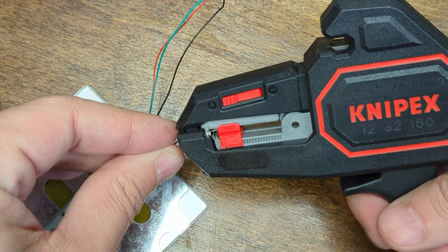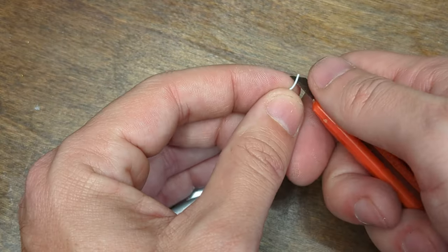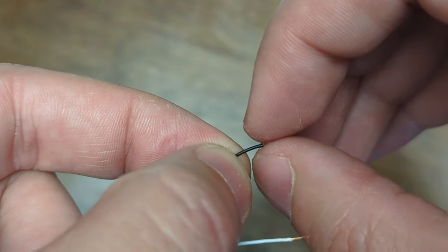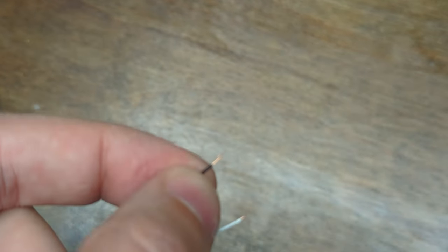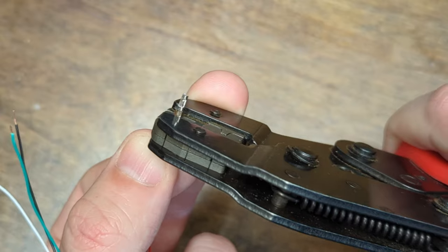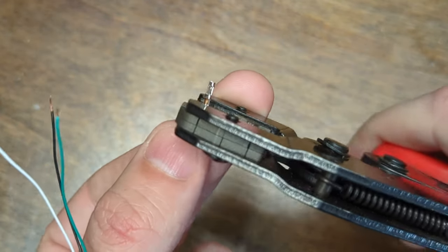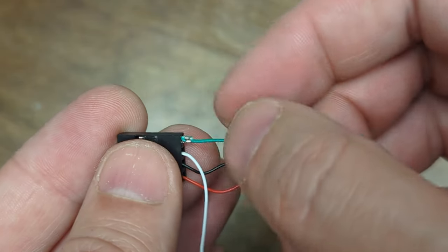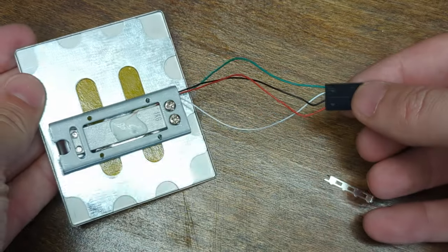So I started off making a pin header for the load cell where I immediately found out that my wire strippers didn't go small enough. I tried some bad ideas and then I figured out that it's literally as easy as just using my fingernails to pull the insulation off the wiring. Once I finally got that figured out, I was able to finish making the connection cable for this thing, and now I had my load cell all wired up and ready to go.